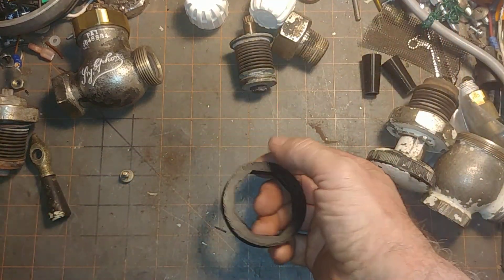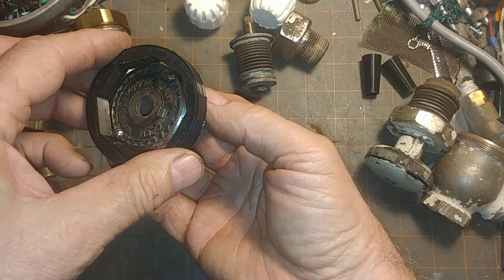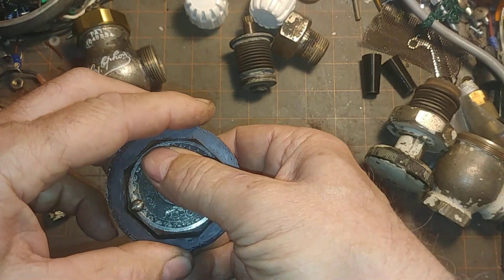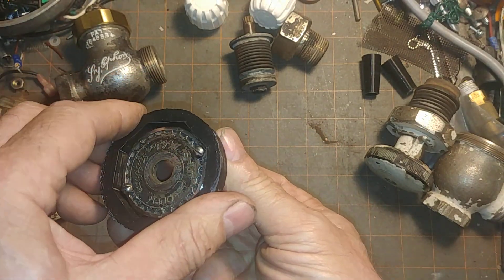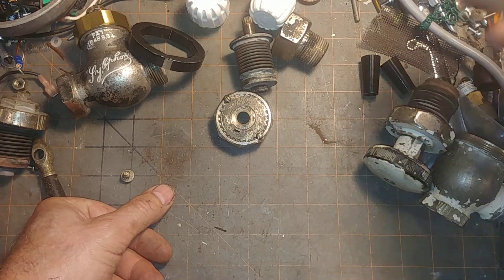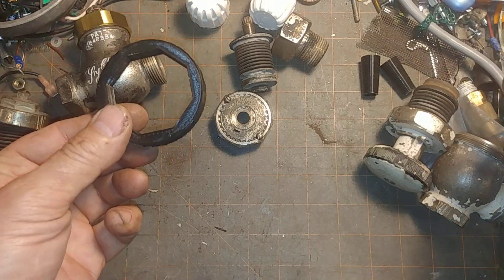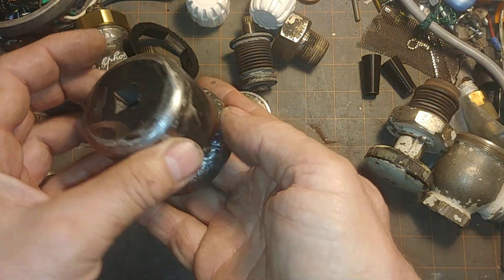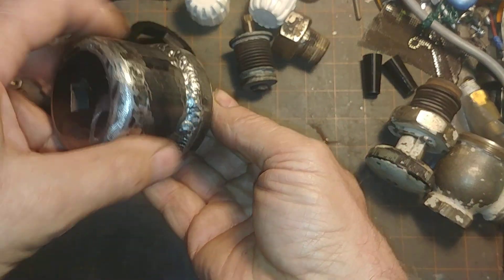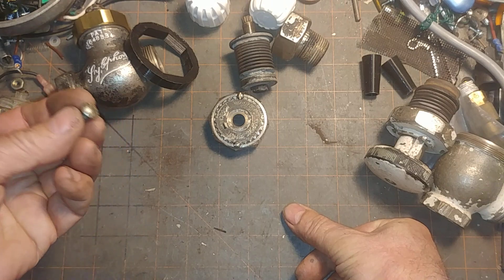What we've got here is a 3D-printed unit, which will get punched out in steel. It fits over there very nicely, and we've loaded the file on a thumb drive. We'll get this back in steel, and I'll use that to weld up a socket which can then be used to quickly remove this where space is limited — and it saves time too.